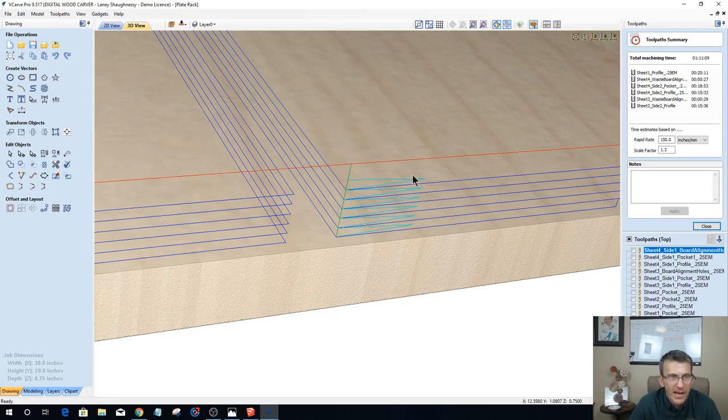Okay. So my pass depth is 1/8 of an inch per pass, William. And for the ramp, I have a 1-inch ramp, so 1 inch back and forth, zigzag motion. What this does is it slowly zigzags instead of plunging straight down to 1/8 of an inch and then cutting around the profile, plunging down, cutting around, and leaving a witness mark. My router is going to come in and slowly drop 1/16 of an inch over that 1 inch length, then zigzag back and drop 1/16 of an inch over that 1 inch span. When it reaches that 1/8 inch depth, it moves around and cuts, then slowly drops 1/16, slowly drops 1/16 till it gets to the next 1/8 of an inch and goes around.